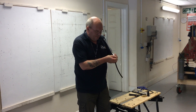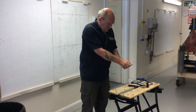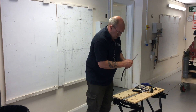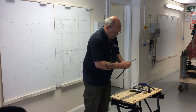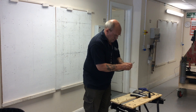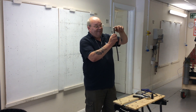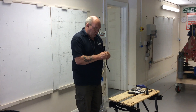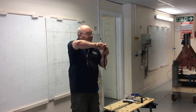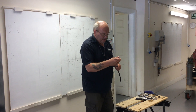Don't try it all at once — pull it off in bits and it should snap off nice and clean with a couple of tweaks. So we've got a relatively flat, nice clean end. If you don't cut it deep enough and try to do that, it bends and you end up cutting it with side cutters, leaving little hooks on top which makes it difficult to terminate. At that stage, get your shroud and put it on first.